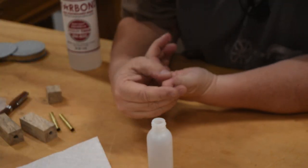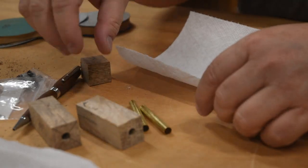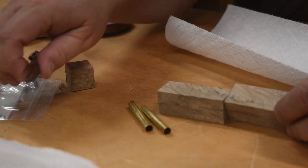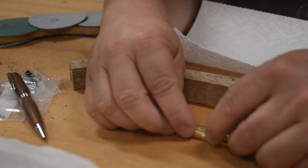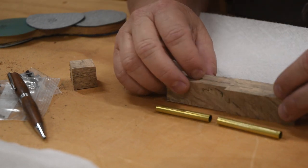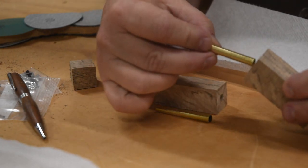I do not use an accelerator to make it dry faster, though I will use a paper towel — paper works a little bit like an accelerator with CA glue, so if you get a little on your finger, just wipe it off with a paper towel and it'll be dry almost instantly. Make sure you have your glasses on in case anything splashes up — there are also some fumes with CA. Make sure you get the right parts: the longer brass piece goes on front, in the orientation where they join. I suggest you glue it from the join, not from the other side, to reduce the amount of material removed so we can get a tighter grain pattern.